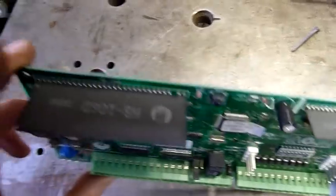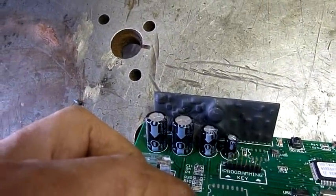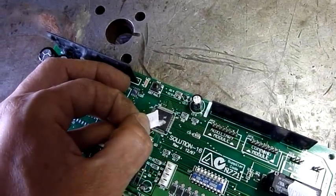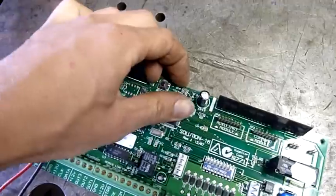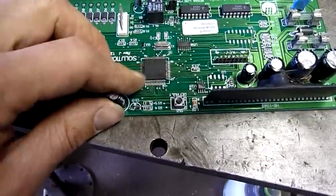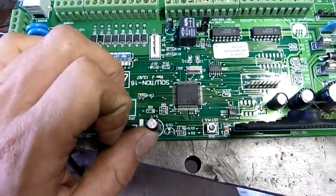Software version 1.4. There are nice big hybrid modules — you can clearly see some inductors, various other surface mount chips, and probably optocouplers. Let's void the warranty and look under the module. It'll be a PIC chip I guess. Reading the markings: Solution 16, V1.4, followed by serial numbers. So it's not even a generic chip — it's actually made specifically for them. Interesting.